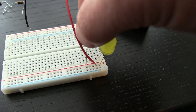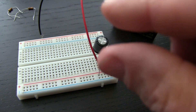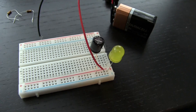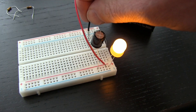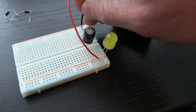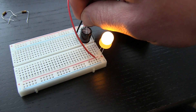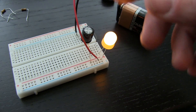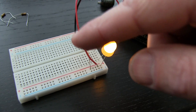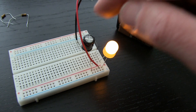Now I've added a capacitor — an electrolytic capacitor. Essentially it's a foil with some liquid in there, two plates separated and all wound up, and it stores voltage. Now you're going to see something miraculous when I take the battery away: it dims out slowly. That's because the electrolytic capacitor is storing energy and it's trying to maintain the voltage in the circuit. Capacitors resist change in voltage, so they're great for limiting voltage spikes — they're like a hydraulic accumulator for electricity. I've put this capacitor in parallel with the LED circuit.